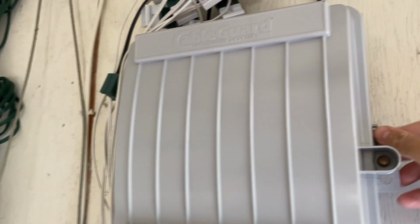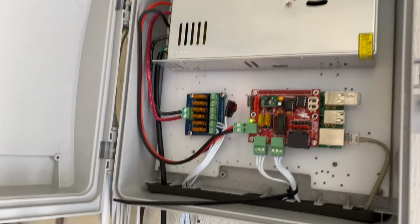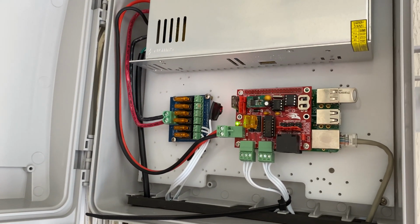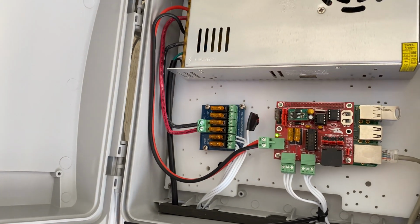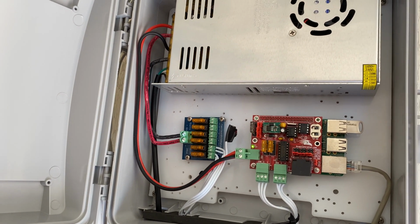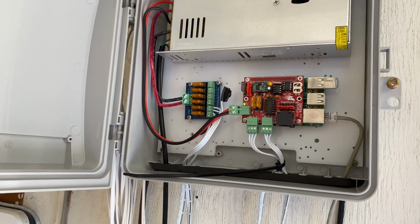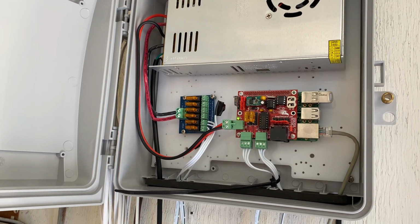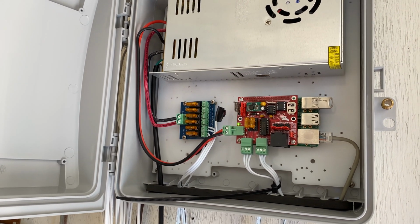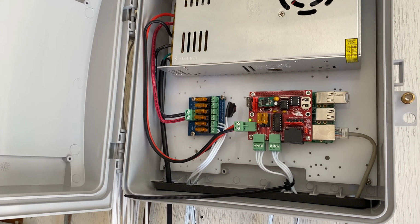But then that brings us to this, which is from the garage side, my Pixel controller, which is really just a Pi cap on a B+. Yes, not a 2B+, not a 3B+. A B+, which I'll be replacing this year, probably with at least a 3, maybe a 4. Then I have an 8 output distribution board on the left there for power injection and what have you. Really I had everything on the garage running off of here, so there's probably 400 pixels on this Pi cap, so probably 200 off of each channel, approximately.